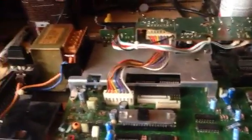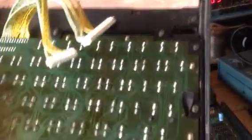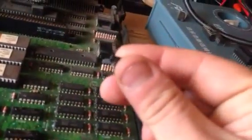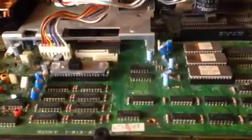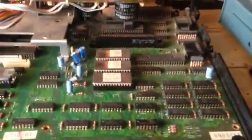The reason I started working on this was the keyboard has never been very good, and it got to the point where it was basically unusable. So I've rebuilt the keyboard - all the switches behind the arrow keys I had to desolder every single one and take them apart, clean them up, and reinstall them. All the little tact switches were dead and you can't take those apart, but they are still available so I swapped them all out and put new ones in. I was really pleased because I didn't lift a single track on the board taking all those switches out and reinstalling them.